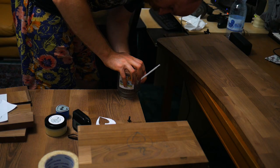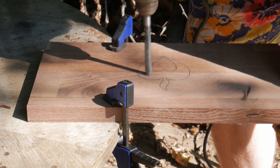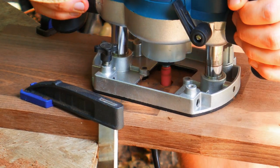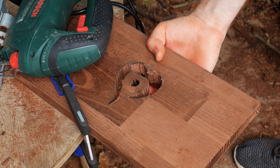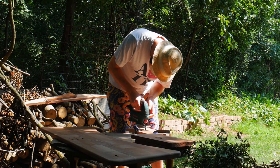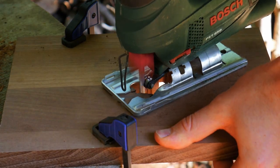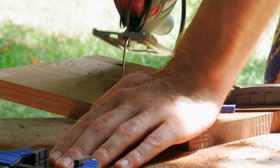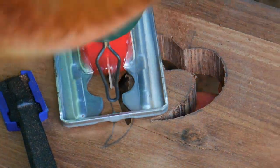I also rounded off every corner because it's just better. The first few cuts were still the learning phase — I used an old and dull drill bit and tampered with the router. I made a mistake and broke a piece, which I started over later. I decided it's better if I cut the chaff with the jigsaw bit by bit. I realized not only can I cut precisely with the jigsaw, I can also practically shave with it, creating a very smooth curve.